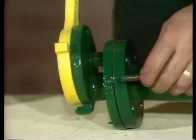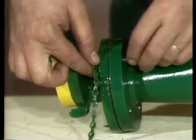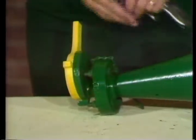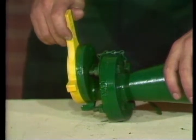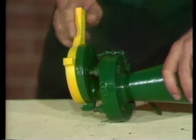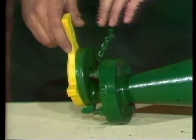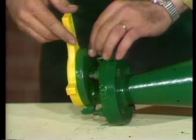The handle must be positioned at 180 degrees from the inlet at the top of the cone assembly. The indexing pin and chain are connected to and installed with the first bolt. The final step is to rotate the orifice plate to make sure it fits snugly against the adapter and base of the cone liner — there should be a slight pressure as you move the plate from one position to the next; otherwise the O-ring will not provide a complete seal. This same orifice control is used on all cones up through eight inches; larger cones use a diaphragm valve.